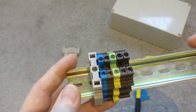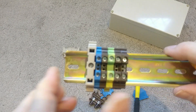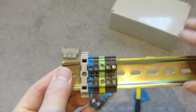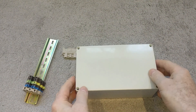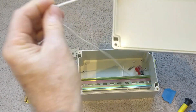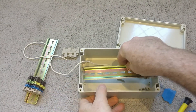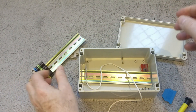The plan for me is to use these in an external IP67-rated box in the garden to supply sockets and lights. I'm going to make up a little terminal junction box using these connectors. I've also got a plastic IP67 junction box here with a gasket to make it waterproof, and another DIN rail that I've cut to size which will screw into the bottom of the box so all of these can be mounted inside — giving me a nice solid connection box.